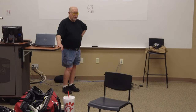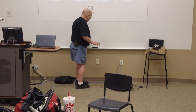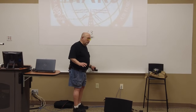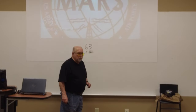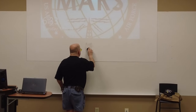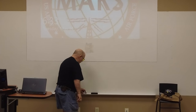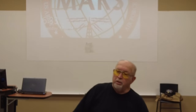That has to do with, especially on an insulated wire, the insulation on the wire. But you won't hardly find any information on the internet on the velocity factor of solid copper wire. So what I try to do is take about 6 to 8% off of the length to start with to get it to resonate.